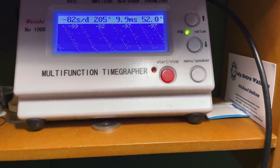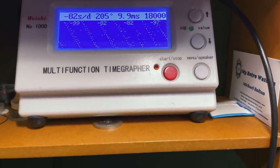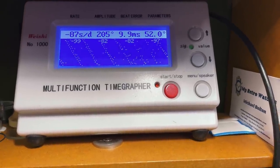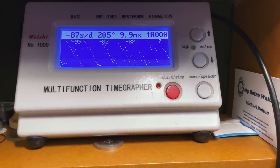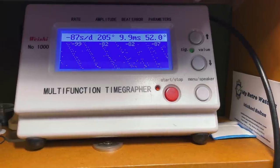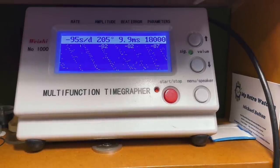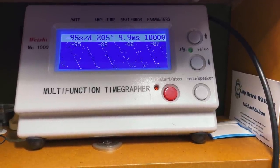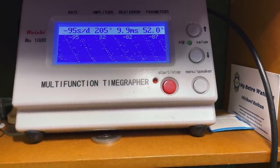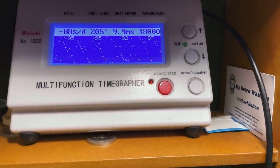And I thought at first, well, okay, I can fix that. That's just a case of moving the collet that the hairspring sits on and getting it into position a bit better, which I did. And every time I did that, I still got a really bad rate, and the beat error is just questionable all the time. I didn't know what to do, a bit out of my depth, so I reached out to some of the pros that I know, and the consensus is it's actually not far out, but I would need to adjust some of the balance wheel screws in order to try and bring this in a little bit better. And to, of course, set the beat would mean shortening or lengthening the hairspring from the stud,